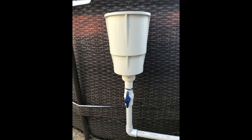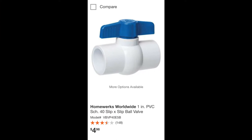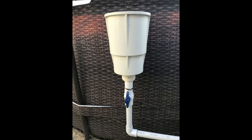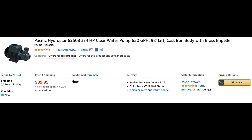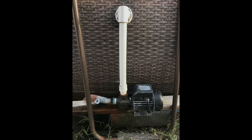This is what it looks like through the back of the pool. On the back of the skimmer you can see where I installed a ball valve that cost me $5 at Home Depot. I did this so I can shut it off — no water goes through the pipe — and I can perform maintenance on the filter. I had an old pump I bought at Harbor Freight for about $100, and I went ahead and used it for this project since it was just sitting around. I figured I could convert the filter box that came with the pool originally and just use it to filter out the water being skimmed.